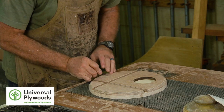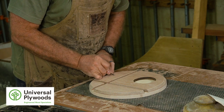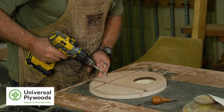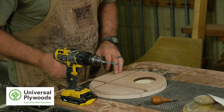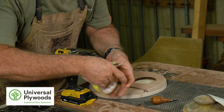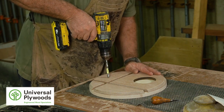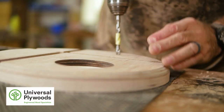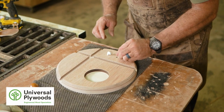The final bit of work we've got to do is make little recesses for our AirPods. I'm using an awl to help me get my hole position absolutely perfect — it's a cool little piece of equipment because it helps make sure that your drill doesn't skip around. I'm going to drill straight down, but I want to make sure I don't go too deep, so I'm going to put tape around the drill bit as a depth stop. Now I've got something to show me where to stop drilling. Let's see if things fit — yes, those look good.